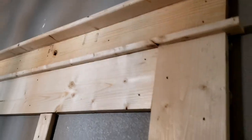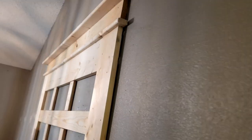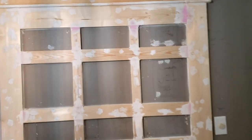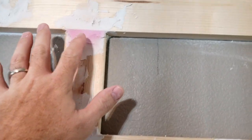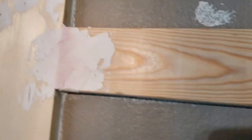This is all nailed and glued, have it all on the wall, and now I'm going to start with some wood putty, caulk the sides and everything. This is the pink stuff — it'll dry white when it's done and you just give it a light sanding, make it look all nice and smooth the best you can get it. Throw some primer on there, throw some paint on there and you're pretty much done.